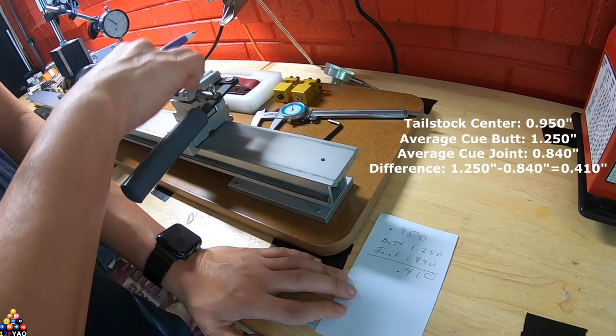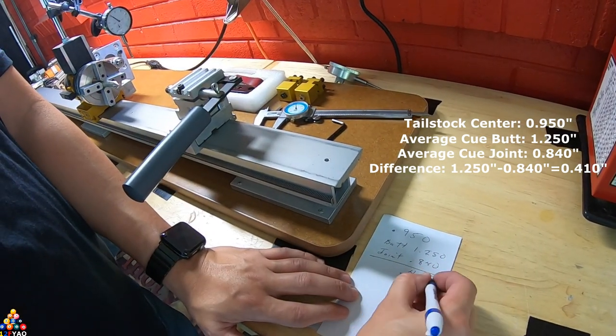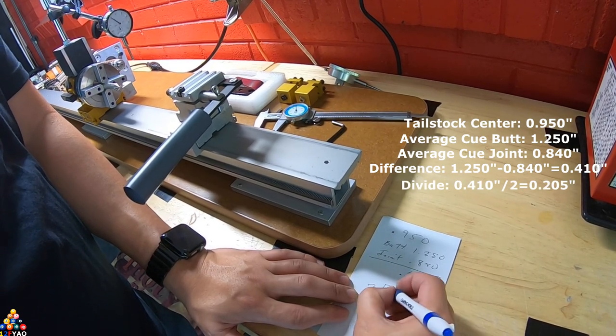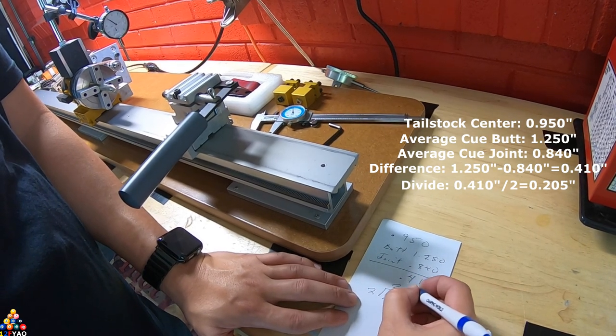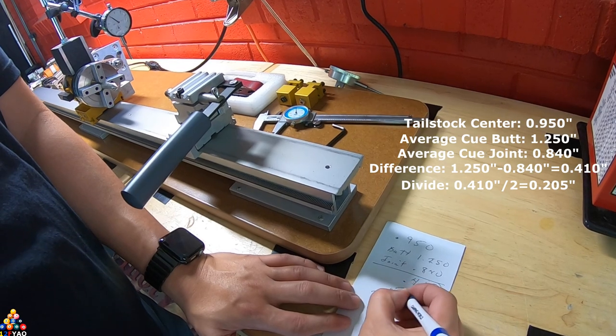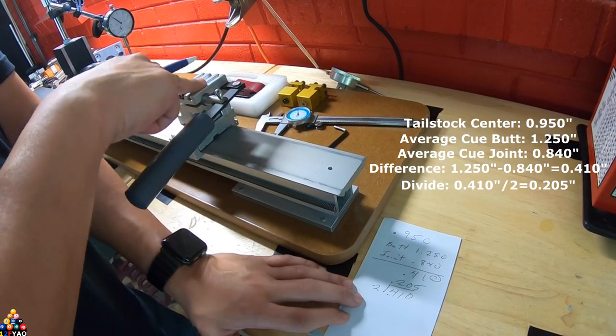But the thing is, when you're using your tailstock with a router, you're cutting both sides. So you would divide this number by 2. So 0.410 divided by 2 is 0.205. So now you have 0.205. That's the distance you need to move your tailstock